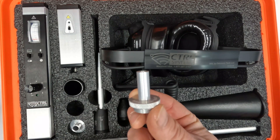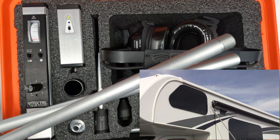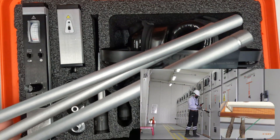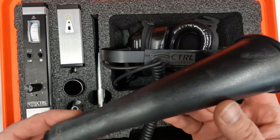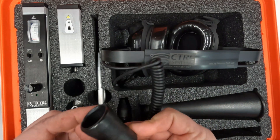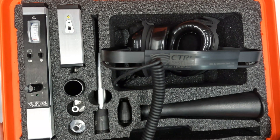The kit includes several acoustic or airborne attachments. There is a one-inch acoustic tip used for leak detection, and metal acoustic probes which are threaded at each end to attach together for safely reaching and pinpointing. There is also a polycarbonate probe for safely inspecting electric panels. The set of concentrator attachments increases sensitivity for leak detection. The large concentrator extends the detection range of the UL101 by 200% and narrows the beam of reception to 5 degrees off center. The mini concentrator increases sensitivity about 150%. There is also a one-inch acoustic tip concentrator, perfect for pinpointing difficult vacuum leaks or extremely small leaks that no other detector can find.